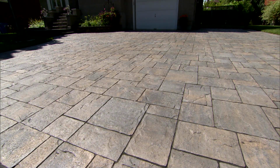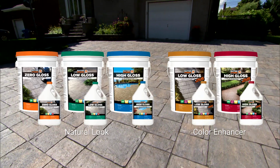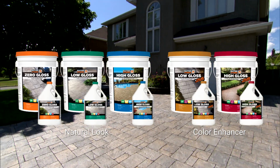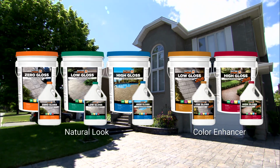Alliance Gator's hybrid sealants are offered with a natural look or with a color enhancer, made with 100% pure high-grade acrylic or acrylic copolymer used to seal concrete pavers. They penetrate deep into the concrete pavers' pores, thus reducing the oil and dirt penetration, as well as protecting them